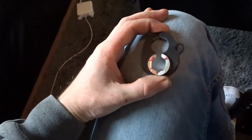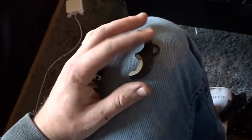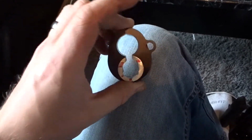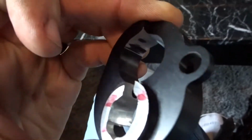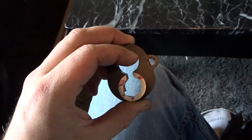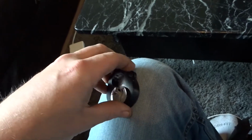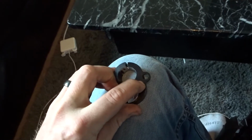So originally, the centers used to touch, and there's a screw that runs through the middle. You can see the holes there, a hole in the side, and a screw hole through the middle. This was supposed to be for a gas tube. This was supposed to be for a barrel. A PSL barrel is 2/100ths of an inch thinner than a Vepr barrel, and this one is even heavier than a standard Vepr barrel. So there was no way.